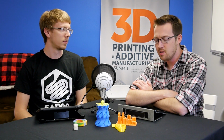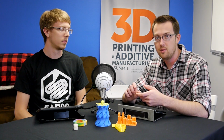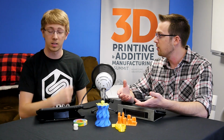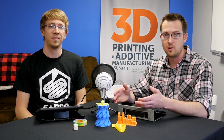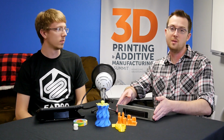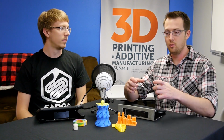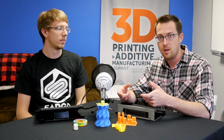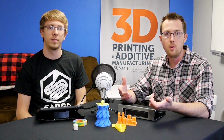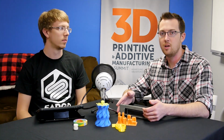And it's amazing how such a simple disc, I mean, that's really all it is. It is about the size of a quarter. It's about the thickness of a quarter too. It's just a really simple cylinder, but it can make all the difference in how much your prints end up warping. So something that's that simple, it's easy to use. You just need to put it at the four corners of your model, and it won't avoid warping altogether, but it'll focus the warping more on where the helper discs are instead of having it hit the corners of your model.